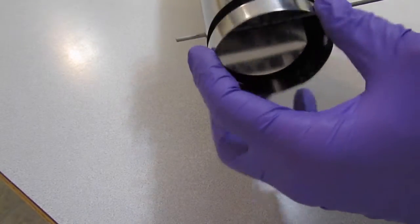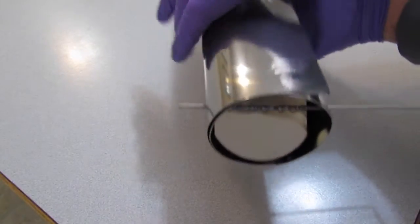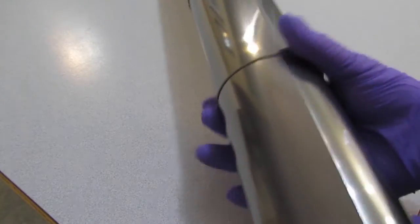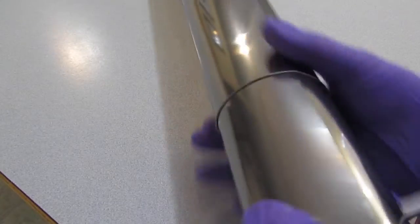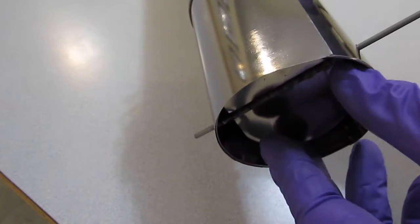You're going to feed your ring onto the inside of the pipe. Like that, just right at the very end. And then you're going to roll your cables back. So these cables are a little bit smaller than that ring, so the ring is forcing the pipe out and this cable here is forcing the pipe in, that way this ring here is now locked in place. It's going to keep your pipe from collapsing.